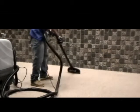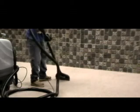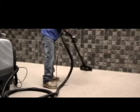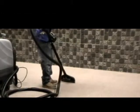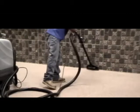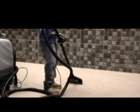This stroke removes more moisture and helps dry the carpet. The wand is then shifted sideways for the next backward pass with a 2-inch overlap. Depress the valve trigger again and pull the wand straight back. The process is repeated, moving left to right or right to left, depending on which side of the room you started at, across the room until the entire room is done.